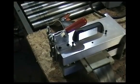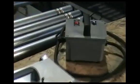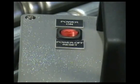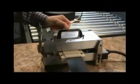Make sure the control unit is plugged in and then toggle the power on button on the control unit. The button will light and remain lit for the duration of the welding cycle, which is approximately 35 minutes. When the welding cycle is complete, the cycle complete indicator light will come on. Simply toggle the power on button again to turn off the heating unit. Both lights should go dark.